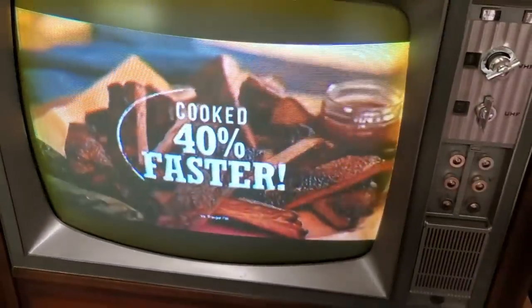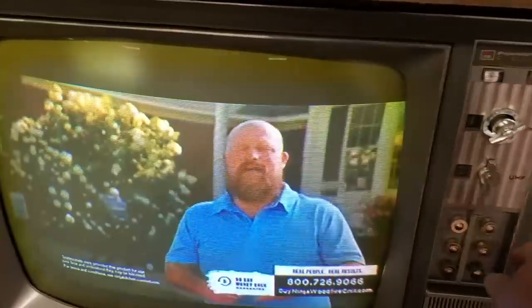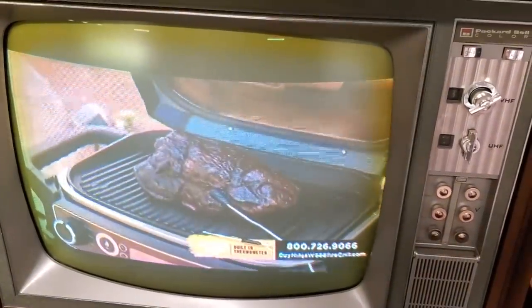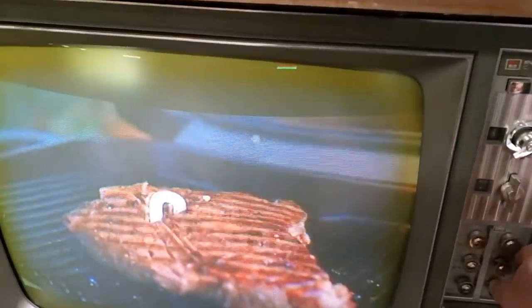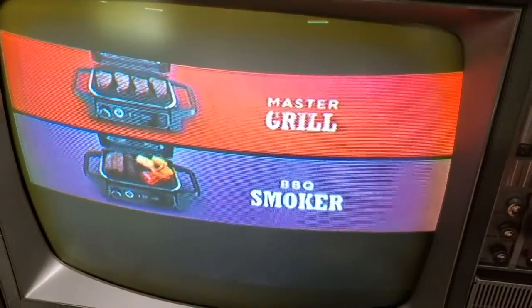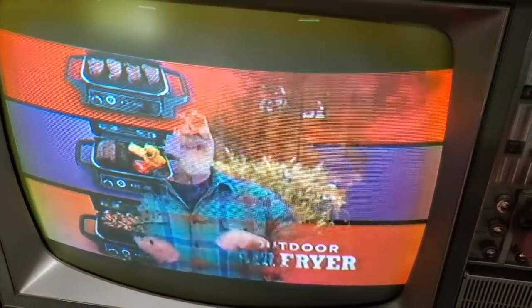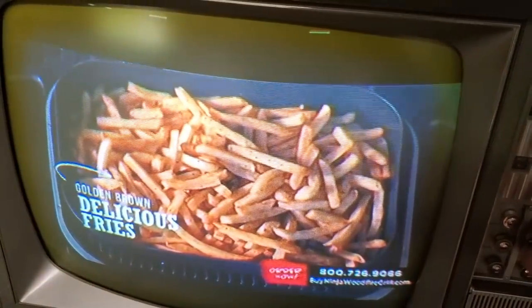Anyway, it's Sunday, April 2nd, 2023, and the TV has been running flawlessly. So I don't know why I kind of jumped to the conclusion that the diodes didn't fix it. It's been rock solid — I haven't touched it in over a week. It's been great. So the diodes definitely fixed the horizontal soft lock. It's a very common failure on old TVs — the selenium diode.